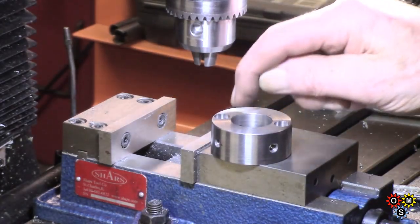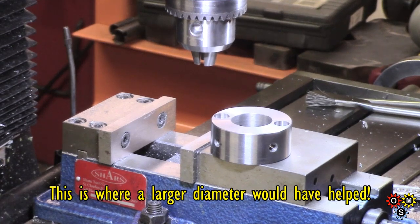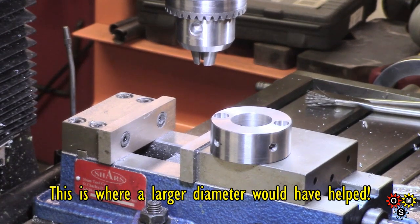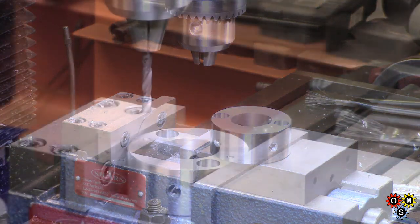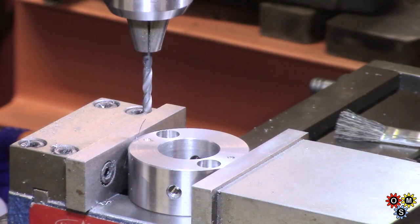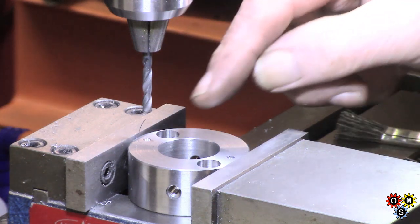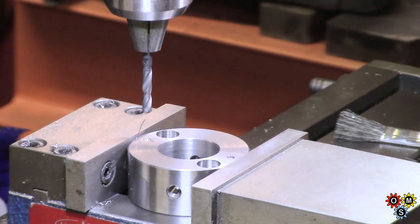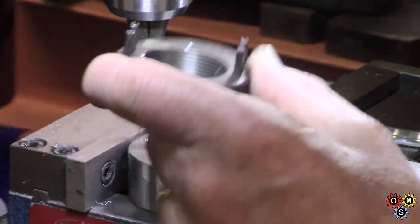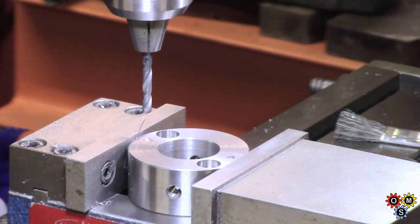I'll have to go next to these, make another pair of holes for fixing bolts, and use 10-24s. Yeah. I should have gone for the 10-24, shouldn't I? Never mind. I'm shifting these out by 25 thou each, so that plus a smaller tapping hole should be, we should be alright in here I think. It's just extra stupid work because of screwing up.